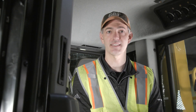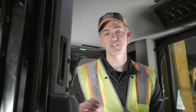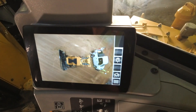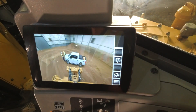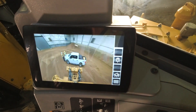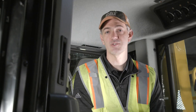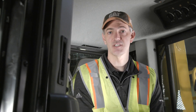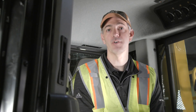Our third option is the Vision 360 system that includes four cameras to provide multiple views, including a top-down view of the dozer. The image displayed on the 8-inch display depends upon gear selection of the dozer. The front view can be provided for new operators in a push-to-edge application to be helpful, and of course the rear view while backing up is always provided. Depending upon how the dozer is configured, the Vision 360 system will provide greater than an 80% reduction in blind spot over an operator's line of sight within 50 feet of the dozer.